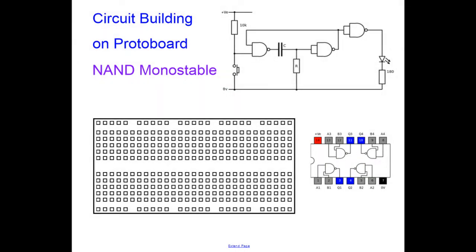Now we're going to build a NAND gate monostable using the 4011 NAND gate chip. It's a confusing-looking circuit with things looping backwards and around. We start as always by drawing the chip in the middle of the board — it's 14 pins, 7 down each side, connecting across the trench. Draw the notch, label it, and immediately connect the power supplies using nice short wires: pin 14 to the positive power supply and pin 7 to the 0V supply.